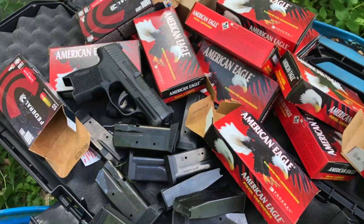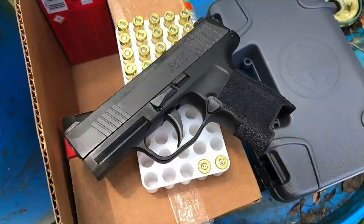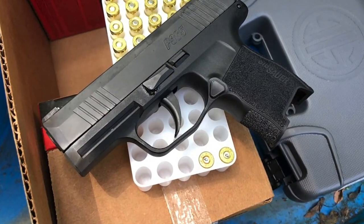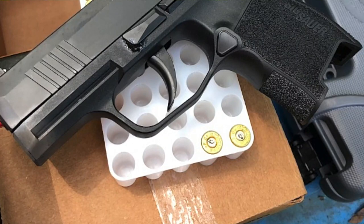All right guys, so we fired 500 rounds with no malfunctions through the 4th P365. We are seeing the very, very heavy primer smearing with the tip of the firing pin or the striker protruding and dragging that to the very edge of the primer pocket, which is one thing that I think contributes to the high failure rate of the strikers in these handguns historically.